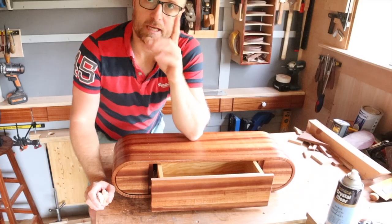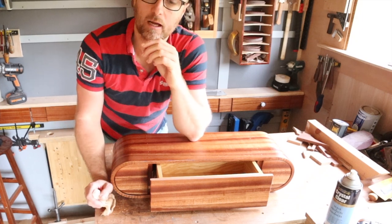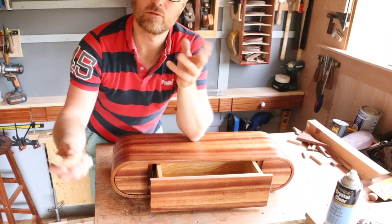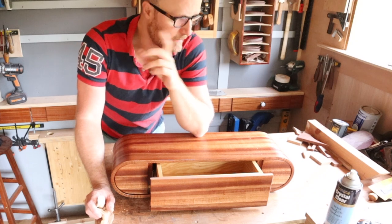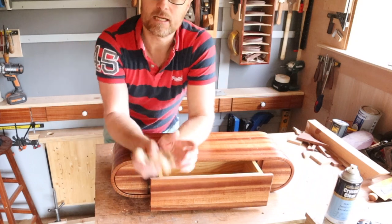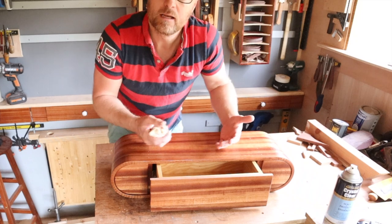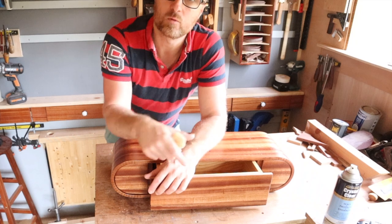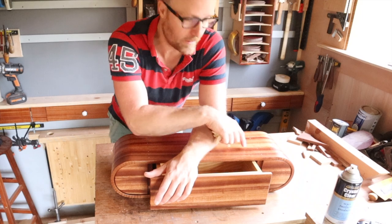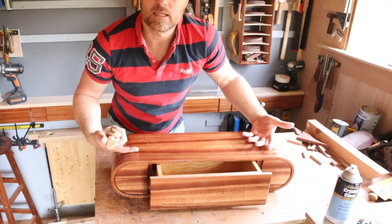Everything got a good sanding down to 240 grit, wiped off the dust with a tack cloth and we're on to the finish. I didn't want to bore you with watching me do all of the first layers of lacquer. The first thing you need to make sure of is getting all the dust off with the tack cloth, blow it off with your pressure down, whatever you're going to use. It's a couple of layers of lacquer put in closer - probably six inches away, give or take. I'm just using a spray can for this like I do on all my projects. I'm noticing it's not giving quite the sheen that I want and I'm a bit worried that lacquer isn't going to protect the surface. So I will take some advice - pop down in the comments how you would finish this. I'm up to about three coats of lacquer and this will be my fourth finishing coat - I'll give it a rub down and then put the lacquer on top. Let me know if you would use something different, something more hard wearing or better looking, because I'm always learning.